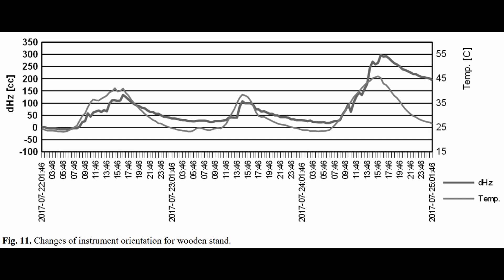What we can draw from this study is that temperature fluctuation does have a clear and perceptible influence on the error introduced on the orientation of a total station from the tripod it is set up on. We just can't say exactly how much change in temperature causes how many arc seconds of error, as there are just too many variables in this study.